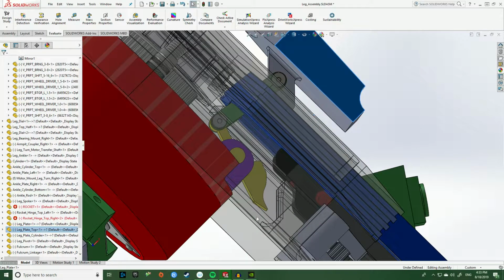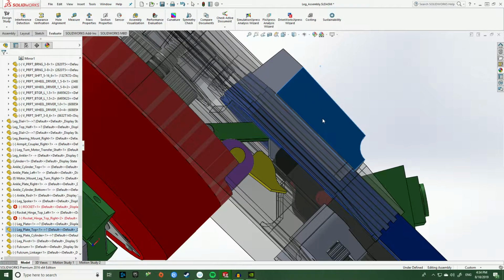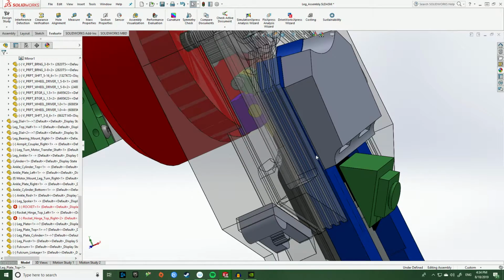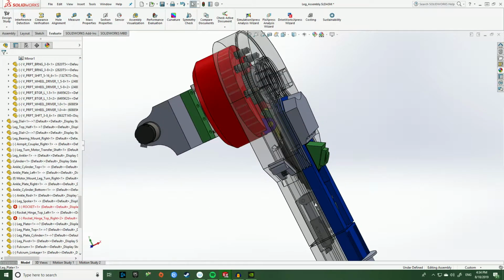One thing I will be doing is I'll be installing a spring down here, so once this piece right here begins to return to its zero position, the spring will effectively push on the fulcrum and bring this gray part back down to the position it needs to go. So this is more or less a high-level understanding of the animation that drives the rocket for R2.